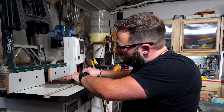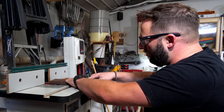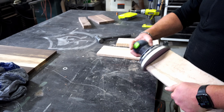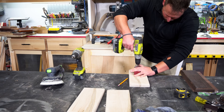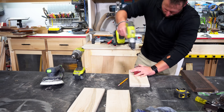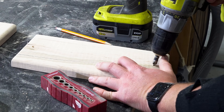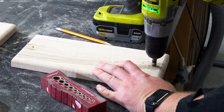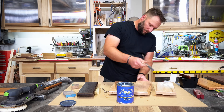To keep things simple, I just did a half inch round over on the front faces, then sanded down to 220 grit. I also pre-drilled the mounting holes and used a countersink cutter so the screws will sit flush once it's mounted. Then I applied three coats of finish to prep for final assembly.